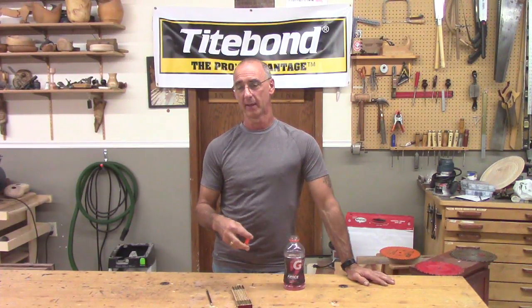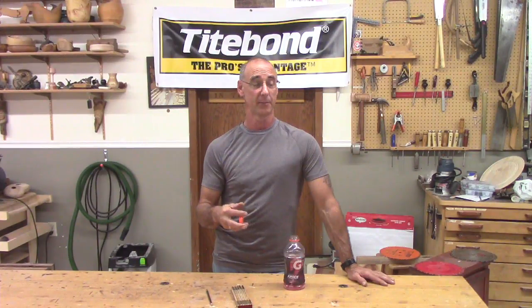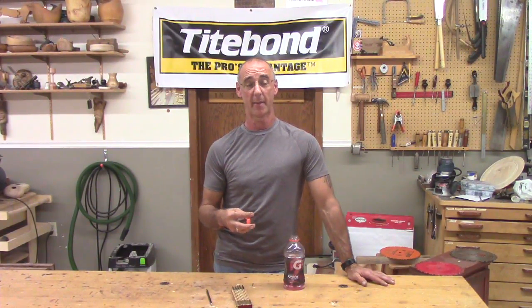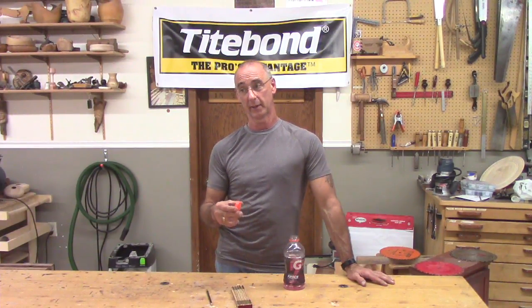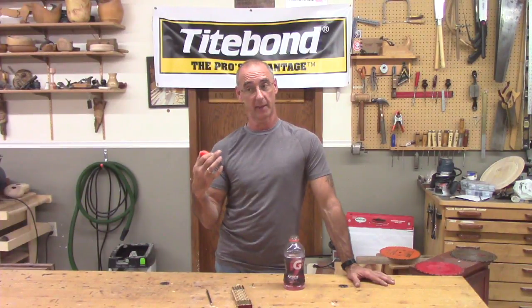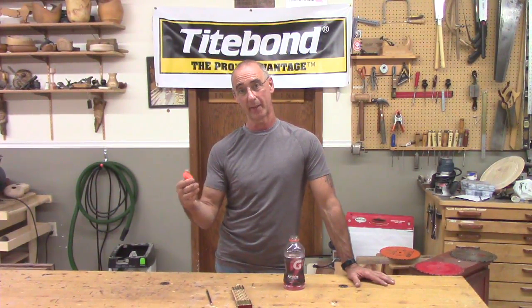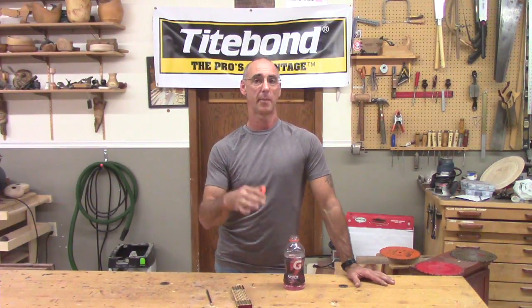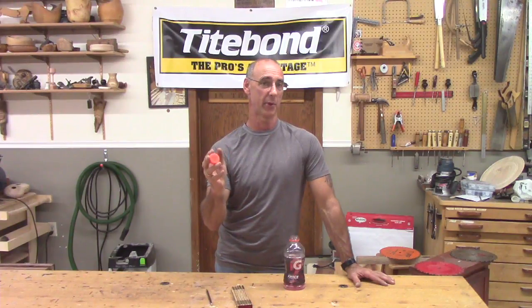Particle board, so we had this conversation just a little bit ago about MDF. Particle board is going to give you the same problem. I think what I would do, if it's raw particle board, I would sand it smooth, and then I would seal it with Zinsser seal coat or a primer, a BIN primer, before the paint goes on. And I think if you do that, you're going to get a much better result than just putting paint on.